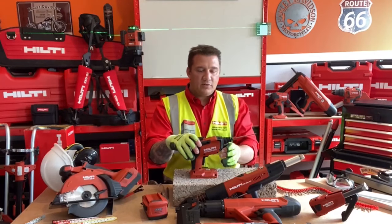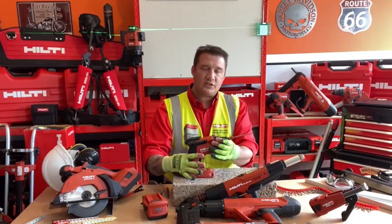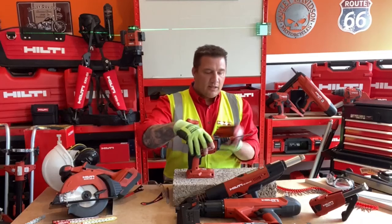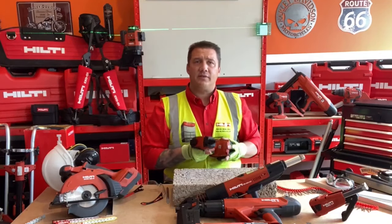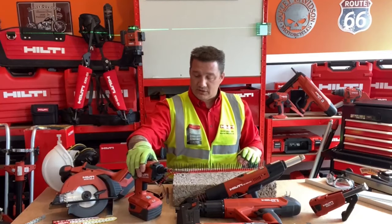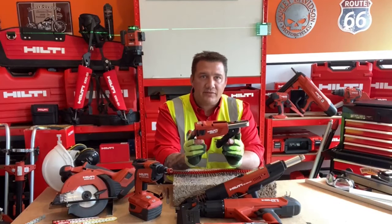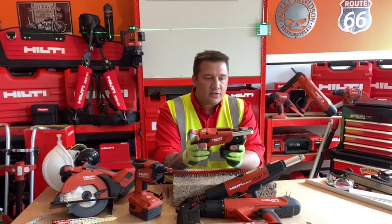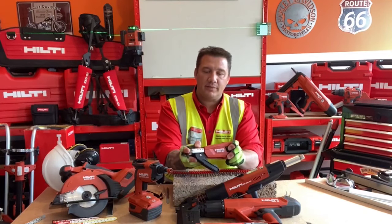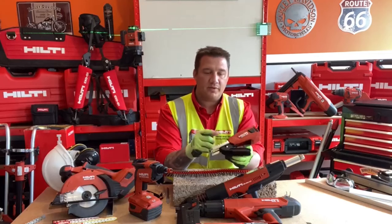We're going to use the SD5000, which again you'll be familiar with — new brushless motor, LED light, new ergonomic grip, very comfortable, and a re-enhanced trigger for better control over screw depth. We're going to use the 5.2Ah 22-volt battery on this one — it gives good weight, great feel, and good power for this sort of application. The screws we're going to use are fine point coarse thread into the wood, and we're going to use the longer collated ones because Hilti now offers the new improved SMD57 screw magazine. When adjusting the depth gauge, it's a simple case of pressing the button and pushing it back and forward — a lot simpler than before — with five options.